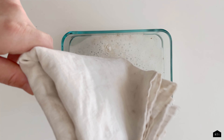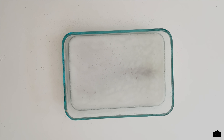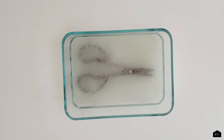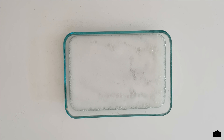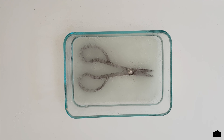You want to be careful about adding too much baking soda and how deep your tray or bowl is, because the baking soda is going to fizz and foam up from the reaction with the vinegar — you just don't want it to overflow. Depending on how rusted your tool is, you might only need to leave it in the vinegar for an hour or two. These were so heavily rusted I left them in the tray overnight, probably for at least 24 hours, just to make sure it really loosens up all of the rust.